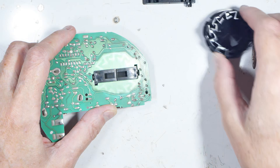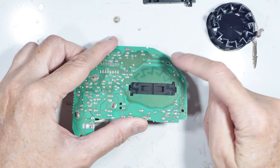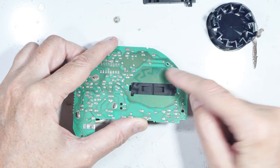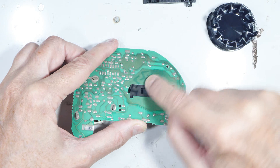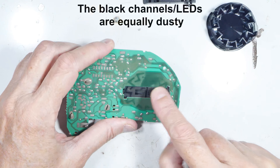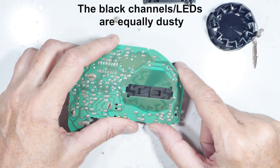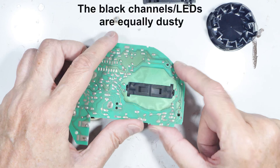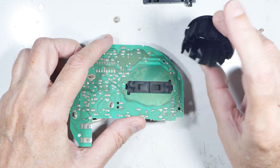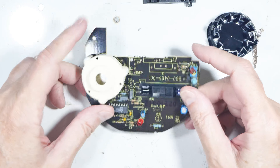You can see — let's see if I can get a good shot on that. Yeah, this is full of dust. Can you see that where I rub the dust off right there? This one failed because basically the channel got so dusty that it would no longer do its job — it always thought that there was smoke in the way.